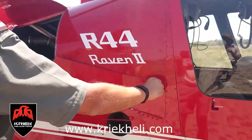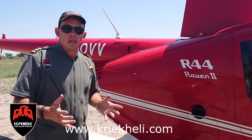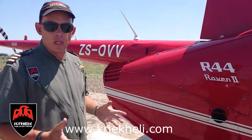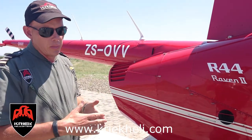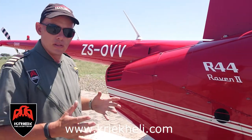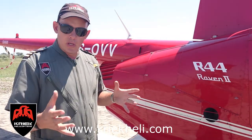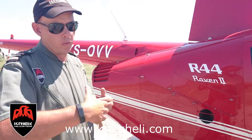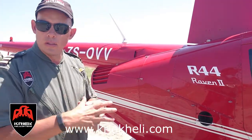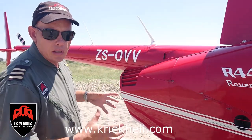There's your visible oil glass for your main rotor oil level. So it's a very easy machine to pre-fly. It's got an equivalent of a 9-litre Lycoming IO540 engine — it's a flat six-cylinder. It runs at about 2700 RPM, so it's a low-revving engine, but very reliable. They are also derated to ensure the engine reaches its full life with no reliability issues. The engines are extremely reliable.